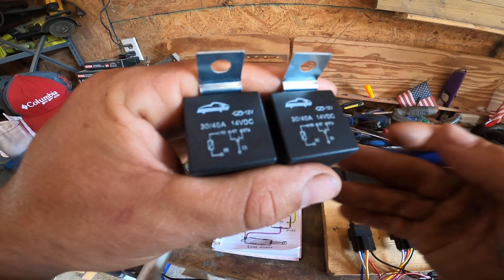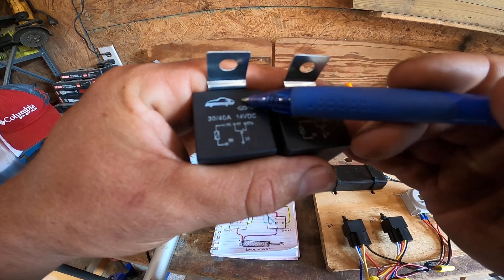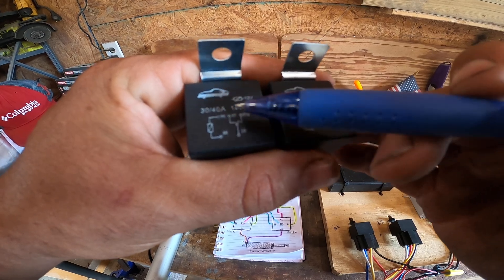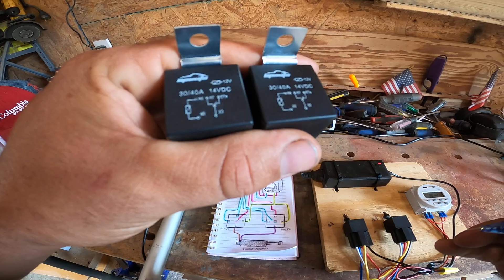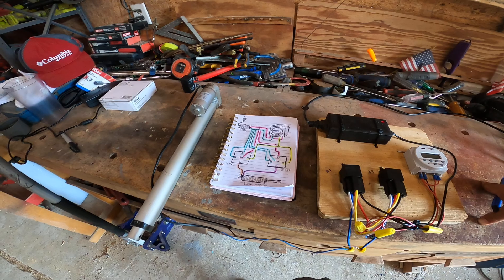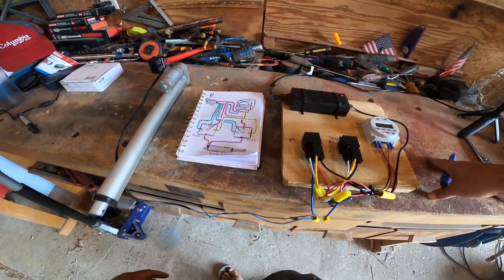That's what gets you where you need to be. When the magnets are not energized, relay one outputs a positive wire and relay two outputs a negative wire. Once the magnets get energized, they flip over — relay one outputs a negative and relay two outputs a positive. That's pretty much it. If you have any questions, leave a comment. If you like it, shoot a like or subscribe. If you hate it, I don't really know what to tell you — I'm sure somebody has something to say about it either way.